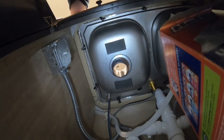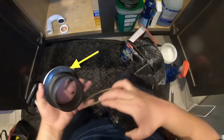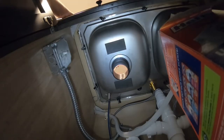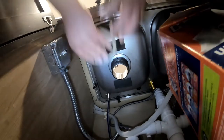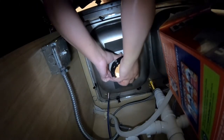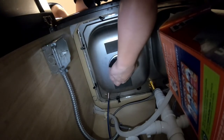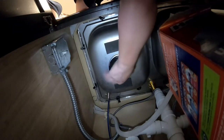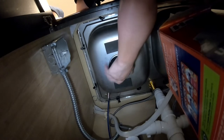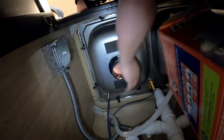Now this is the new piece. Remember that the rubber gasket needs to be in place once you install this part. Make sure that's seated, then put the other piece on the bottom. First I'm putting in a cardboard ring — that's just to make the nut slide the way it's supposed to. Then install what I believe is a three-inch nut that secures this part in place, turning clockwise until it's really tight. Remember, on the other side the gasket is what prevents leaking.